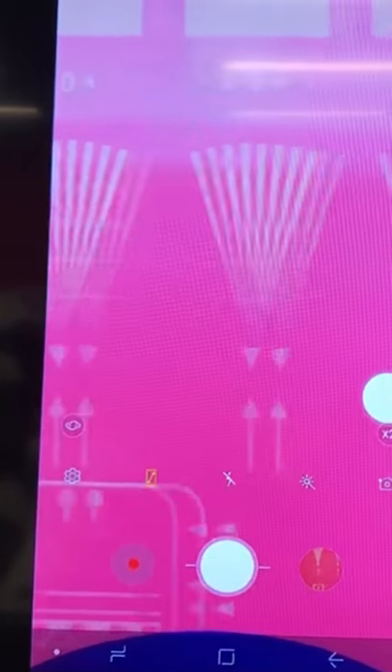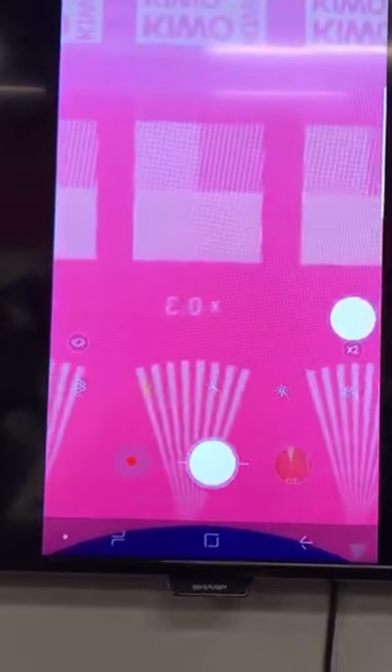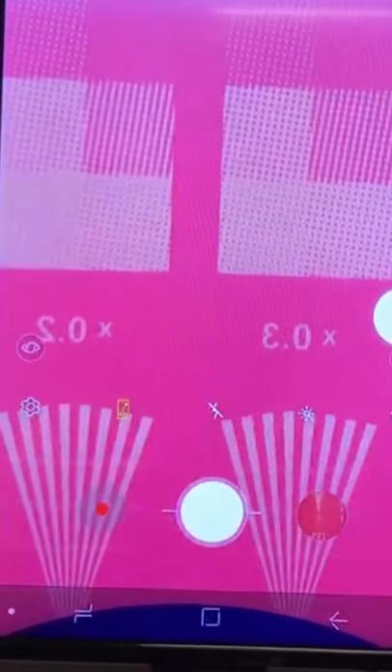Now going all the way over, we'll see that we start closing in. Down at the bottom we start closing in our lines. On 0.8, we've almost lost them. Going farther across, you can see on the full one-minute exposure time that we have loss. We can see at the 10% exposure time that we are closing in — we've lost all of those dots. That's overexposure. Coming back to row two and three, we see a much better exposure result.